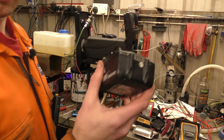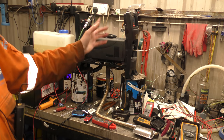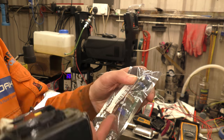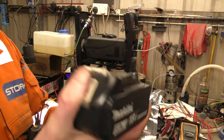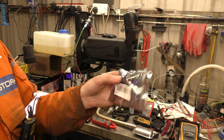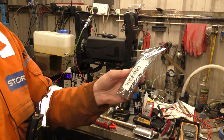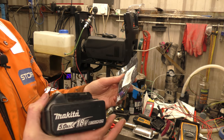The other thing is, when these are fully charged they are 18 volts, and I don't know how well this setup would deal with 18 volts. So I purchased a little power converter module. You can adjust its output — we'll tune it to 14 volts, because 14 is more likely what it would be in a running car, or 13.8 for a fully charged battery. We'll wire it all up and see if it runs, or see if it catches fire.